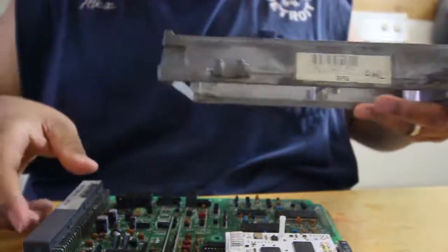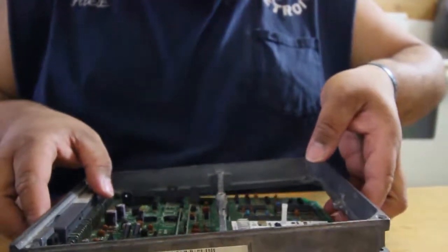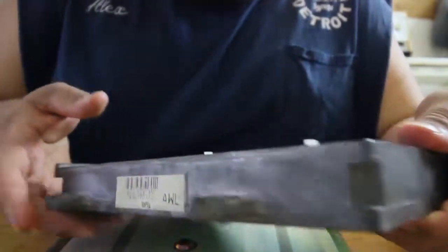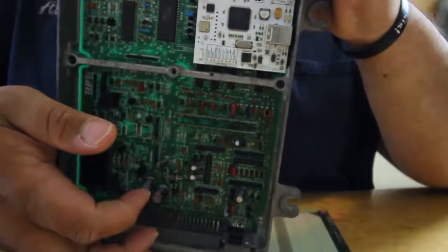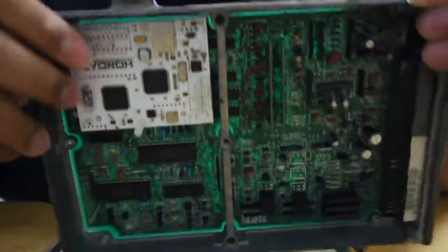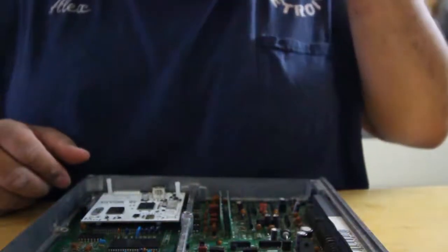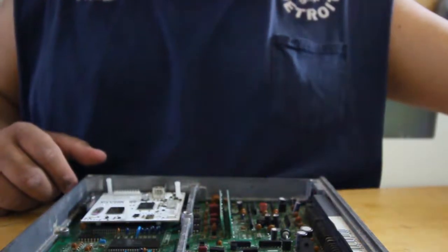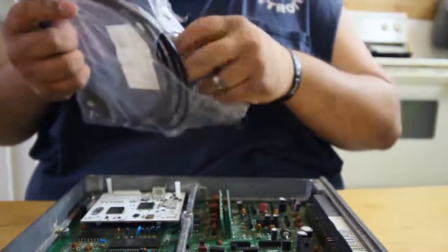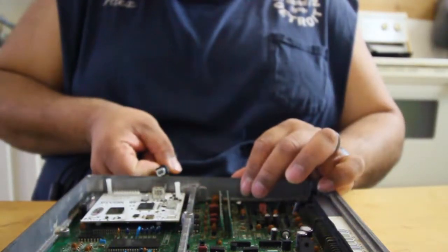So on the body, once you have the ECU inside the body, you gotta go ahead and notch off right here, because that's where your data login port's at now, so you can fit your cable to go through it. Because once it's in there, it just stays in there. It's not like the chipping kit or anything like that. So you're gonna have to just mark it off and see how deep you gotta go in, so you can have your plug go in there.